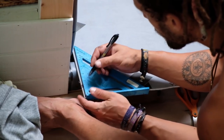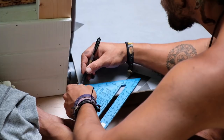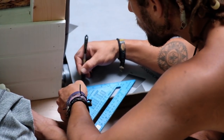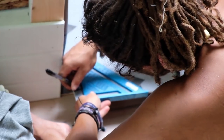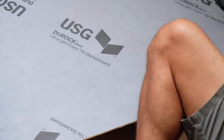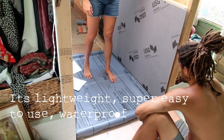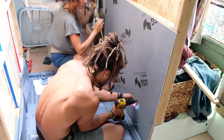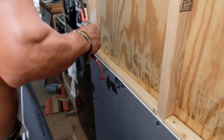So we are cutting just about one inch off where our little ledge is going to be — where we're going to step through the shower — so that the wall comes down a little bit lower than the floor so that when we tile it'll have a nice finish. We're just using the square to mark that out and then cutting that little section off. We chose to use Durock tile foam ultralight tile foam board. So we cut this second piece that's going to attach above here and we are now adding some glue.